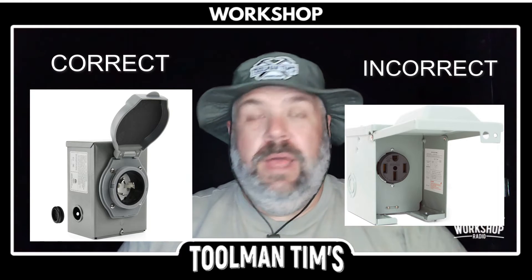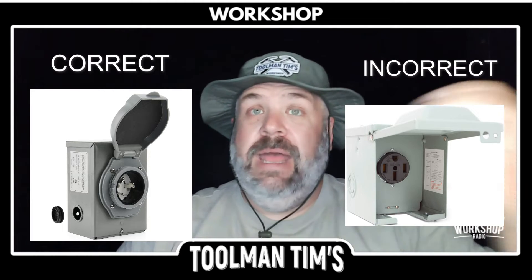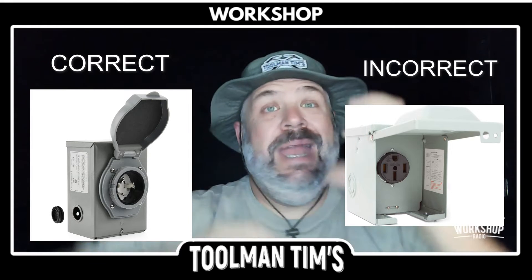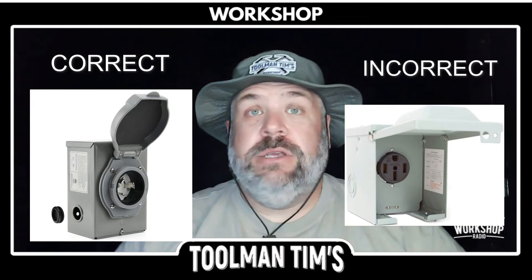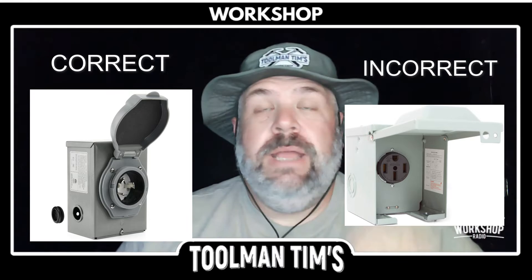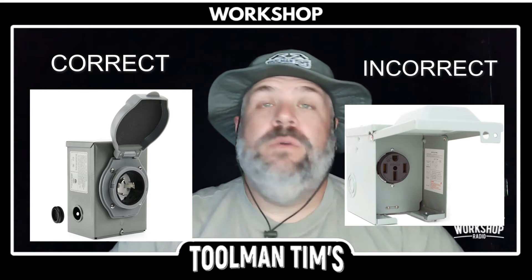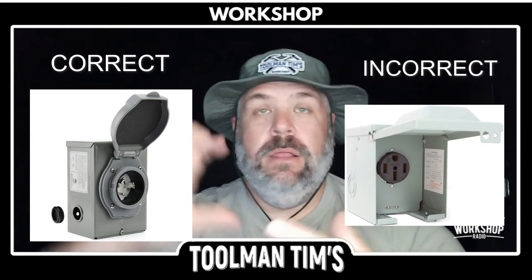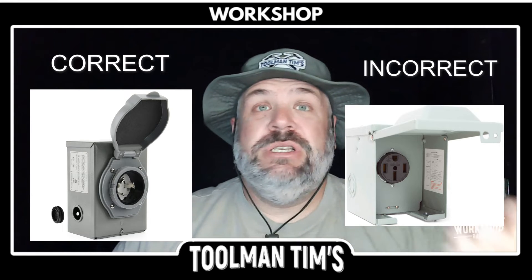I had a female outlet — just a typical 50 amp box on the outside of the house to plug that male plug into. That had to be replaced. I had to actually change that to a special generator inlet. The cover flips up; it has male prongs in there that the female twist-lock hooks into. But it never matters because that breaker stays off inside the house all the time except when I have the backfeed hooked up. Mistake number four — the exterior outlet that I installed wasn't really waterproof. It was made to be outdoors but water was still getting into it. The new one I replaced is a locking 100% waterproof inlet box — much safer and honestly just longer lasting.